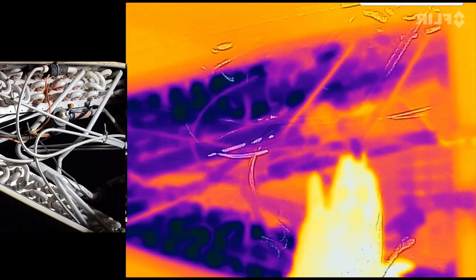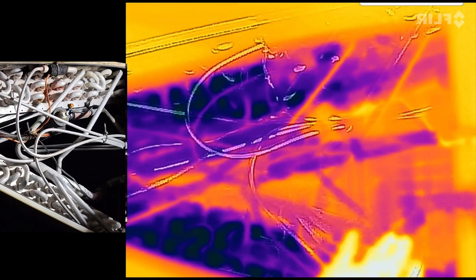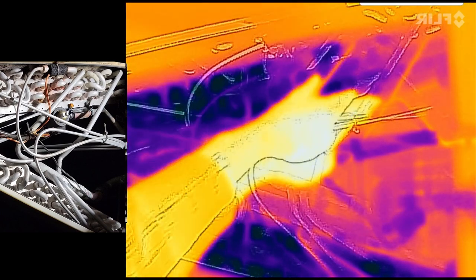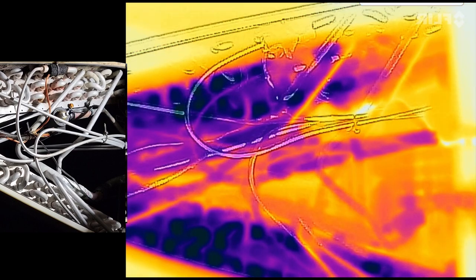And where these pipes here are coming back, that is our vapor. It's just converted, all boiled from a liquid to vapor. All this is saturation, so it's boiled from a liquid to vapor. And then here we're pulling that superheated vapor back, comes over to the main suction line, and that's traveling back outside to the compressor.